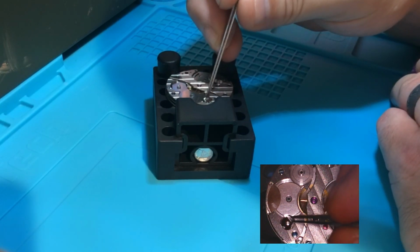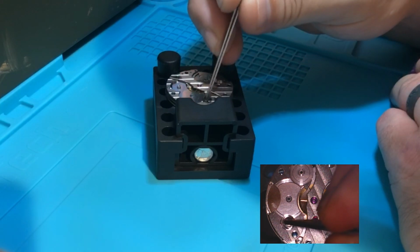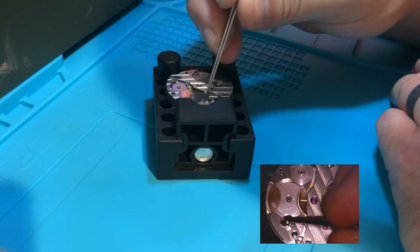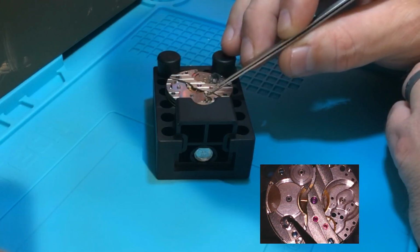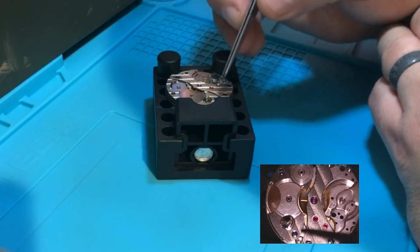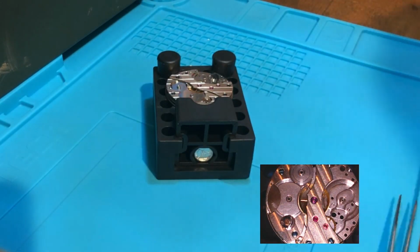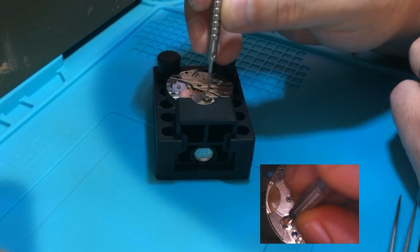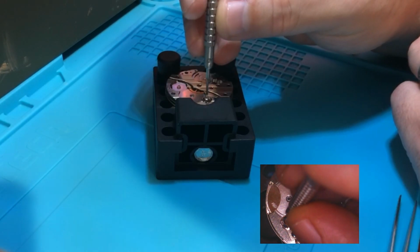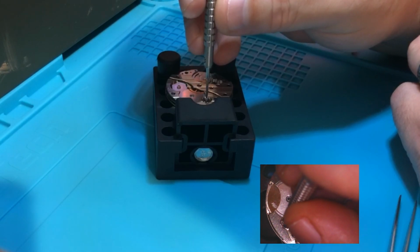Hey, friend, another observation. Is the click correct? It looks like it might be upside down. Am I crazy? No, Ash, you are the most sane person I know. You are correct. After the assembly was finished, the movement would not wind correctly. The click was working, but it did not feel right. I went back and removed it and noticed that I had placed it in upside down. Still learning here, but I had great satisfaction that I could recognize the error and correct it. Thanks again, Ash, for your observation. You rock.